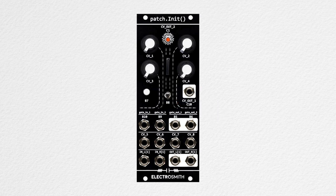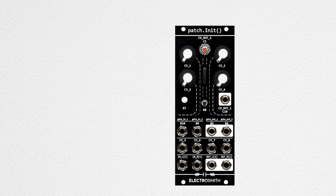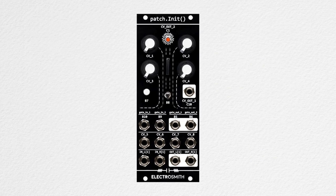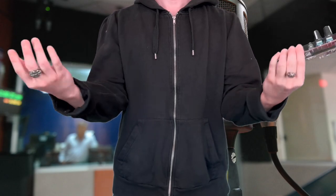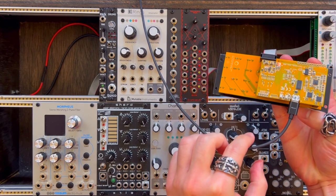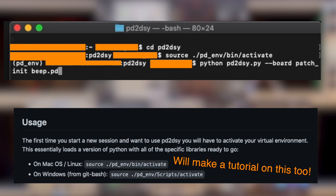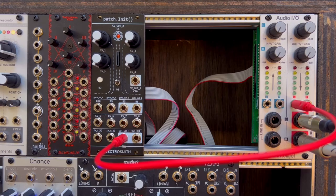This module also features stereo ins and outs, an LED, one CV output, and SD card input. So I can potentially create a stereo delay module — the delay time and feedback could be controlled with CV inputs, and the knobs used as attenuverters. The goal is to fill in all the missing pieces of my modular rig with Patch Init. But first I need to understand how to use it. The most logical first test is to make it beep. I need to install all the necessary software, then plug in the USB, press these buttons, and after following the steps in the terminal, upload a Pure Data patcher. The patcher simply consists of a sine tone and a DAC tilde — so I should hear a beep.